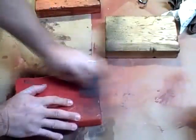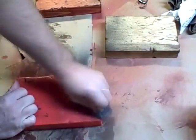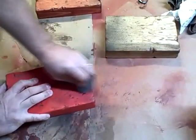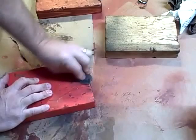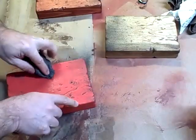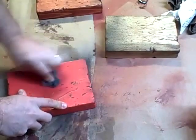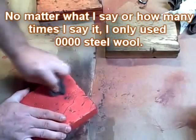I've used this on painted surfaces a good bit — it's kind of cool too. We're just going to use double-ought steel wool and rub it around. Gives a neat effect. It started to take just a little of that paint out, and that's kind of cool — that gives you the highlighted look as well. As you can see, you can get your ridges and stuff.